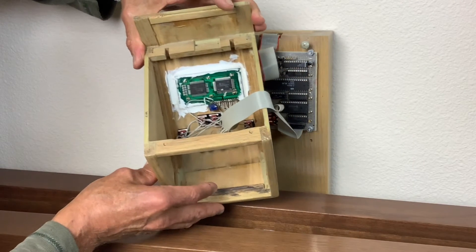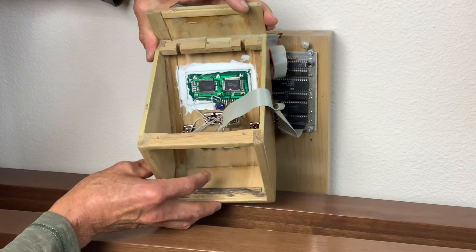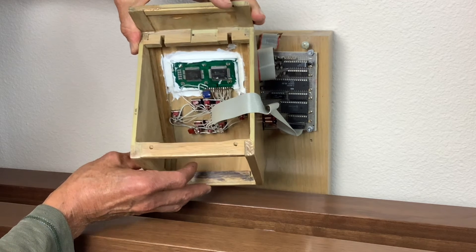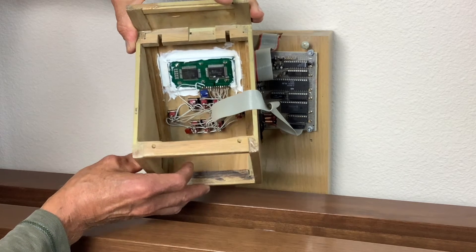The primary components included a programmable microprocessor, A-to-D converter, various small-scale ICs, accelerometers, 10-turn linear potentiometers, model airplane servos, and a 32-character LCD. Eight push-button switches were used for the control input.